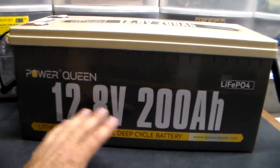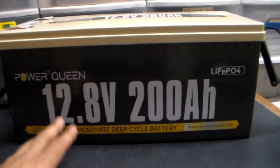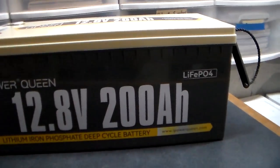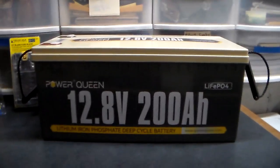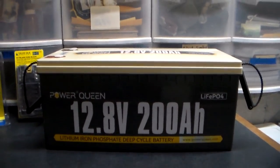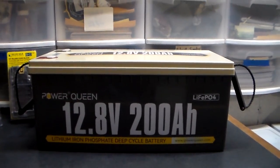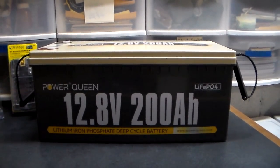You don't have to use this for a water system — you can use it just for backup power. These are some of the components I'm going to use; I'll explain it in a separate video. First, why go with lithium iron phosphate? Lithium iron phosphate has a life expectancy of about ten years. Lead acid is just a few years. The cycle life on a lead acid varies, but you're not going to get over a thousand — probably around five hundred.